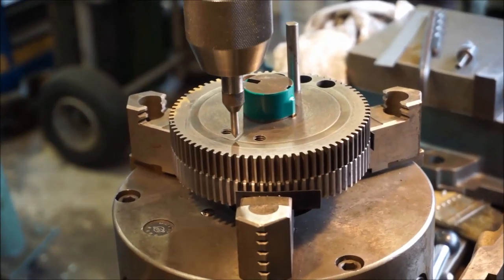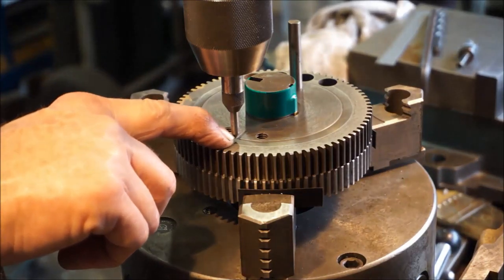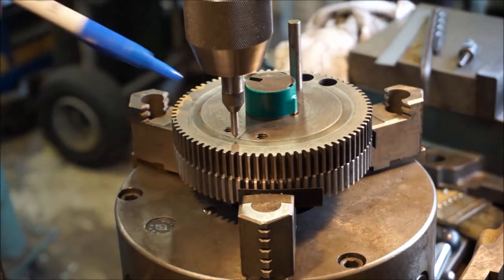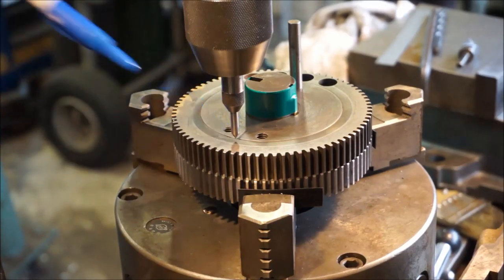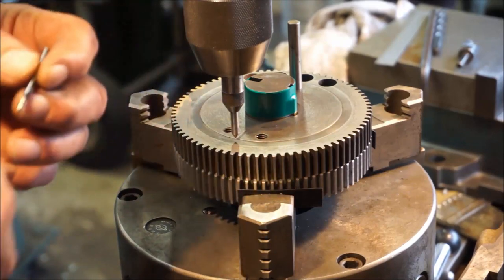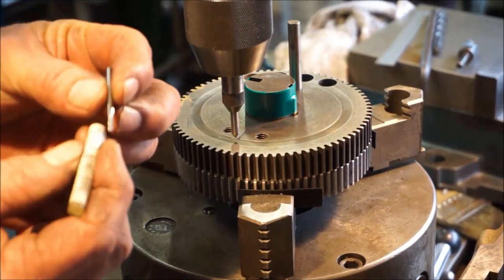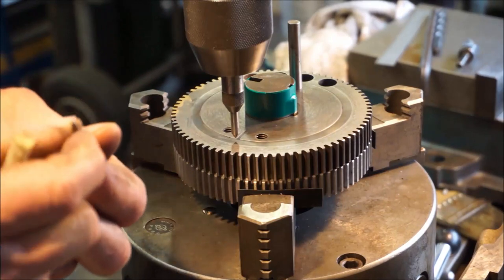I'm going to come out here, and I know that we were out somewhat in this area right here, because of the sweep I could see up here, and where it starts to sweep up over here, so I think just about there is going to be the end of the radius. That's like 0.58. We'll just come back to 0.5. So we're going to make it 1/2 inch long, and we found a little tiny 3/32 end mill. This is carbide. This is a center cutting 4-flute.